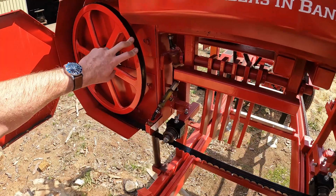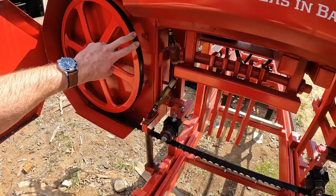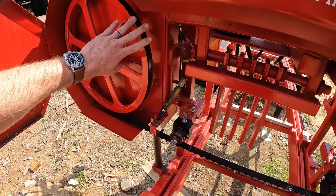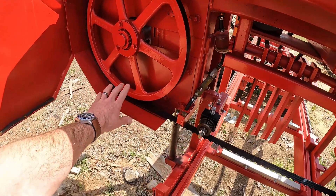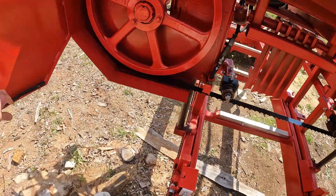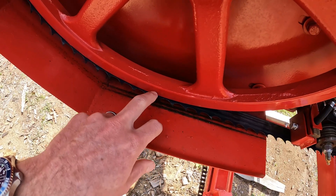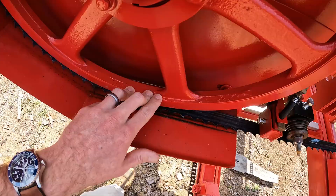There's a high point on that wheel to hold the blade in place. That's a big benefit of having the steel wheels because that is a machine crown. We're precision grinding these wheels to get a lot of life out of them. But that crown is what holds that blade in place. So that's the first thing I'm looking for — where the blade's riding on the band wheel. What I want to see is the gullet, the low point between the teeth, flush with that front edge. It can come out an eighth of an inch — if I hang a fingernail on there, that's about what I'm looking for.